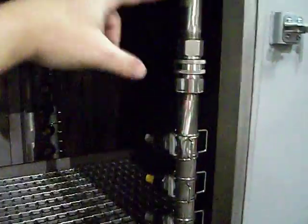You'll notice another set of curtains, and another set — if we keep going, a third set of curtains. These prevent steam from escaping from the system and help prevent cross-contamination. You have those same baffles in the center of the system right here, and another set at this end of the system as well. This is the rinse section, which also has traveling manifolds here and under and back around, as well as over here, down and around under the conveyor.